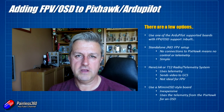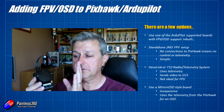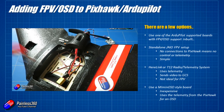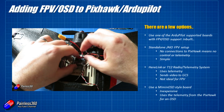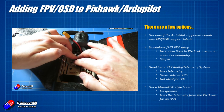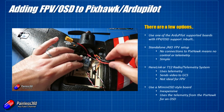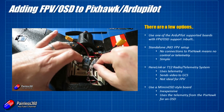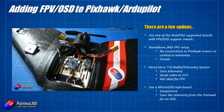The first option if you want to add FPV onto an Ardupilot plane or Arducopter build is to not use the Pixhawk at all — to use something like this. This was a build done a while ago putting an omnibus flight controller, a £20 flight controller with Arduplane, in a little 600mm AR wing. It works really well. About a year to a year and a half ago, a developer created the on-screen display pieces, and it supports the OSD inside the omnibus flight controller that iNav and Betaflight use.